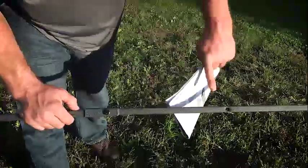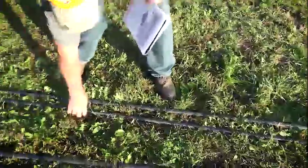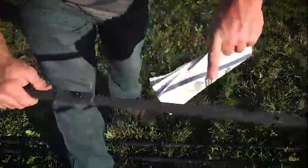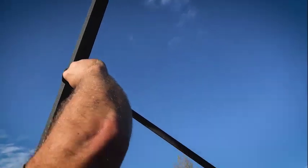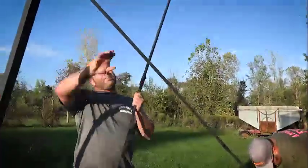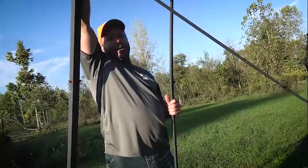Female one is 13 inches from here to here. Okay, female two is 7 inches from here to here. Then female three is 15 inches from here to here. Okay, so you definitely want to make sure that's correct. Your female part has to be on top. Also, make sure that your bracings are on the outside of your tabs.